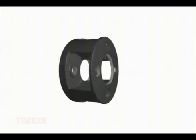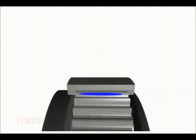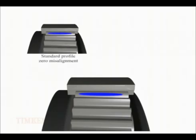Understanding conventional designs. If you examine the design of a conventional planetary gear system, the carrier often twists and deflects under torsional loading. This occurs because the carrier webs bend, advancing one of the carrier walls ahead of the other. Ideally, if misalignment were 0, the contact stress at each mesh point with minor profiling would be well centered on the effective gear tooth face.